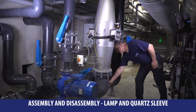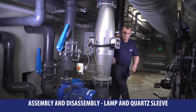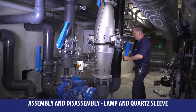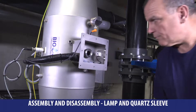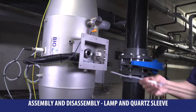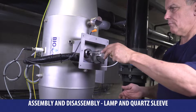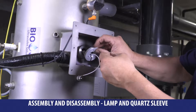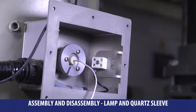Close all the purge valves from the reactor or the pipe. Open slowly the isolation sluice gates and close the bypass sluice gate. Take a few seconds to check that there are no micro leaks. Handle the lamp by the extremity and replace it as slowly as you can inside the quartz. Replace properly the centering rings and fix them on the knurled nuts.